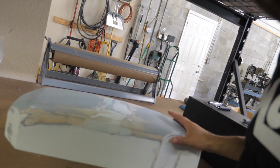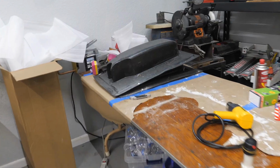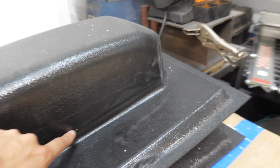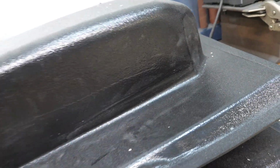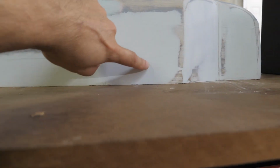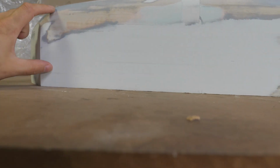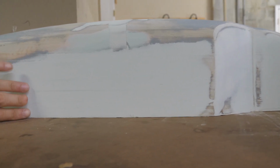This is the buck or mold for our vacuum forming on the battery lid. We did a couple. I'll show you how those couple came out. I wasn't crazy about the results. This little dimple made it really hard to get the mold out of the plastic. So what I did was really smooth this thing out. That dimple effect was happening around here where we have a third layer of wood. The transition between the two was not good and it was creating a little hookup.